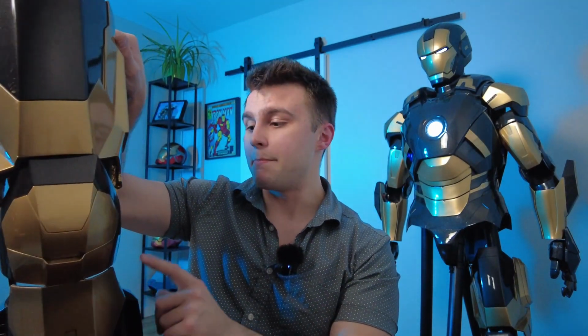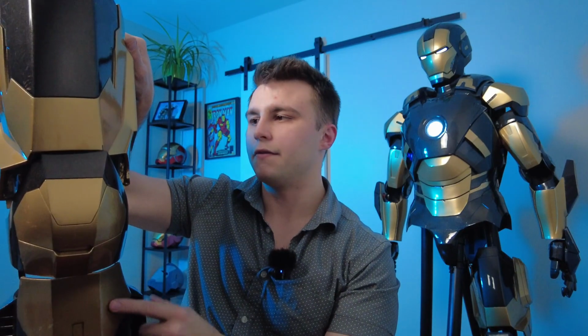To be quite honest with you guys, getting the hinges to be aligned with both the shin and the thigh before fusing everything in place was a pain. Next time I do something similar to this, I might modify the STL files of the shin and thigh to create slots for the mounts. That way I don't have any guesswork. It's already pre-aligned with everything.